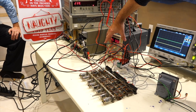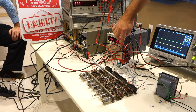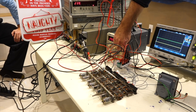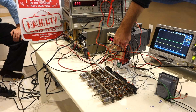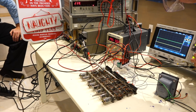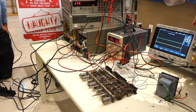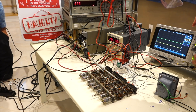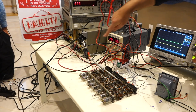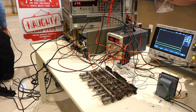So then you want your input voltage? That's on, isn't it? I just test there. And - okay. And I need to push a button? Yes. It went up. It did something. It went up and down. The input went up but the output didn't do much, because it's on the divide-by-10 divider. You don't have it hooked to the counter. Well, not to the counter, but I have it hooked up here. Okay, so this is not sensitive enough.